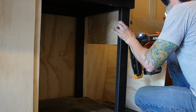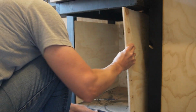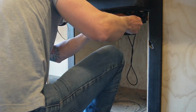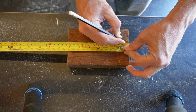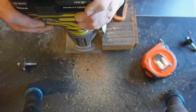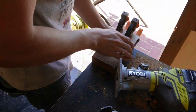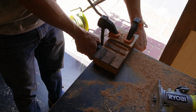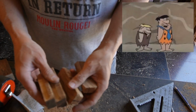Then covering the rest of the internal cabinets. Fill that in a bit later on. But what about handles for the sliding doors, you might ask? Well, I used an offcut of hardwood from the doors, made several passes with a round nose router bit, several cuts of my miter saw, and there you go, handles. Flintstone edition. Barney Rubble would be wrapped.